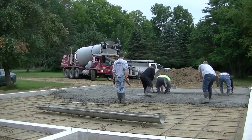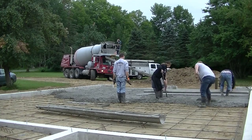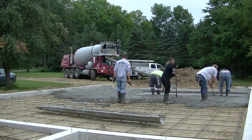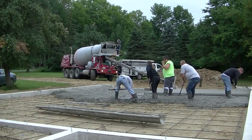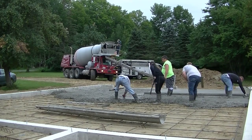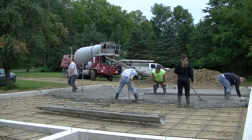All my pads in the middle are going to be slightly different to maintain that slope. You can see how the guys kick screed using those pads to go by. With a couple good rakers — I've got Tia and Luke raking — that just makes screeding so much easier. I'm making another pad so those guys can finish out and screed that bay.